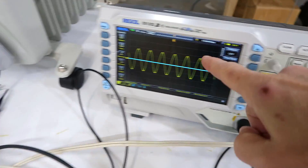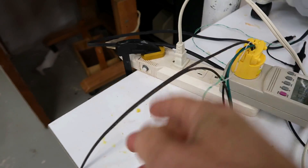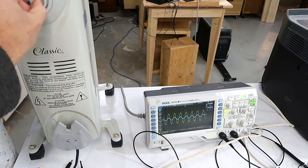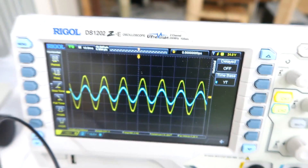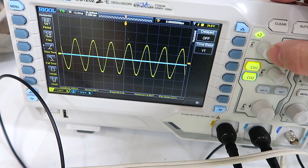I've got the yellow trace on the scope measuring voltage, and I've got a plug and a socket connected, and a length of wire that has 100 milliohms as a shunt resistor, which I'm also measuring with the scope. If I turn on this heater, the blue line represents the current, which is nicely in phase with the yellow, because it's a resistive heater.